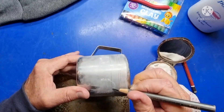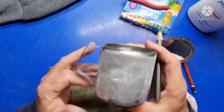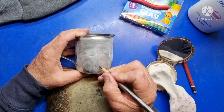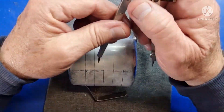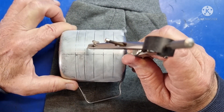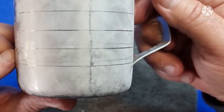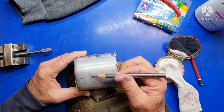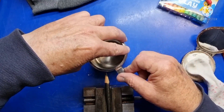A skill all engravers have to master is this — it's quick, easy and convenient. It becomes somewhat redundant when the item is rather high. Some engravers used flexible rules to draw lines, which I found to be bloody hard to get right. Sometimes with straight-edged items you could use a compass, but if you didn't keep it perfectly perpendicular to the job it'll turn out all over the place, and it certainly doesn't work for grapevine-edged ice buckets. For those who can't master the fingernail line-out technique, just put your height marks down the centre line, then mount a pencil in a vise and simply spin the work across it.